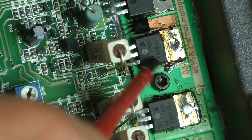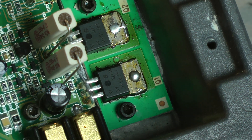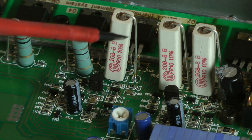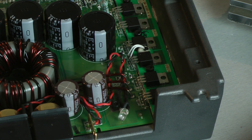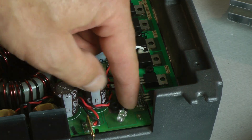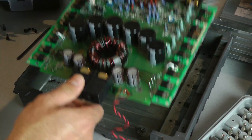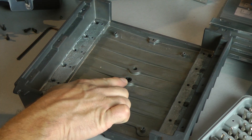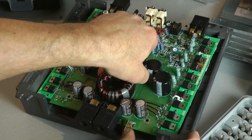After the first check, I found out that someone else already repaired this amplifier. You can see three output transistors have been changed and also the source resistors. But this guy was kind of lazy — the power LED of the amplifier is just clipped on some components of the mainboard. I corrected the position of the power LED; you have to put the wires from the power LED through this small hole here.